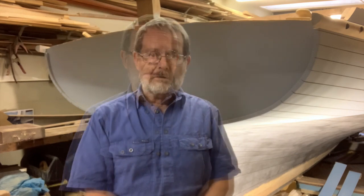There's more fairing to do on the topsides after the seams have been caulked and paid. I'll then be adding a couple of coats of primer and then several coats of the high build undercoat, then sand that with long boards with 80 to 120 grit paper. You can get too particular about fairing even at that stage. In the old days boats were often launched with just a couple of coats on the topsides and then refaired a few months later when the wood had had time to take up. When launching this boat I'm going to have fairly particular people in the crowd so I want it to look pretty schmick, but I'm sure a few months later I'll pull it out and refair the topsides again.